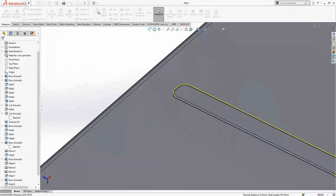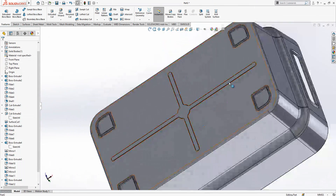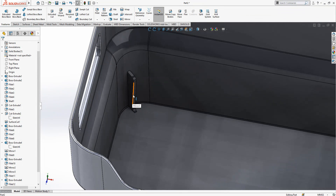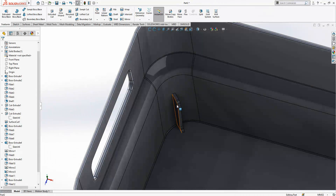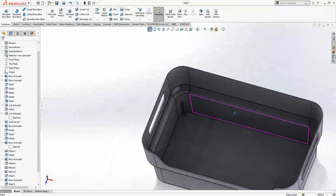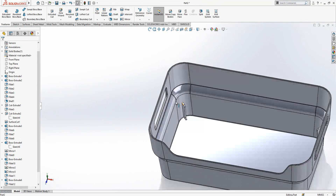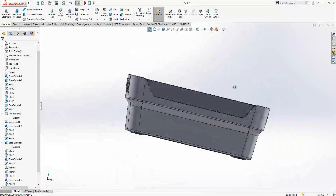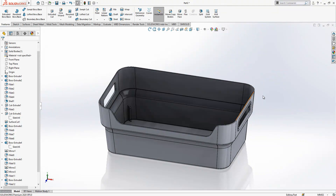The second is removed and then after filleting — yes, I think this was all. We created everything and it's looking fun. I didn't intentionally create a radius here because it's a very thin rib — making that groove on the mold can be difficult if you are not using an EDM machine. For this kind of feature I was discussing with my colleagues from the machine department whether to add radii, and yeah, this is all. I hope one day we can create a mold for such an item together. Thanks for watching — if you have questions please write below in the comments, and if you like the video please hit the like button. See you in another video!